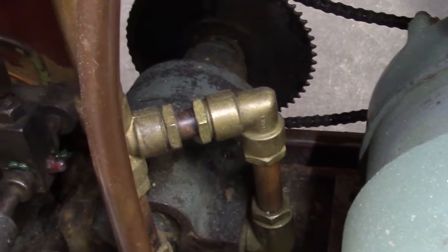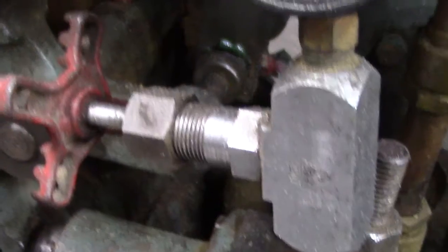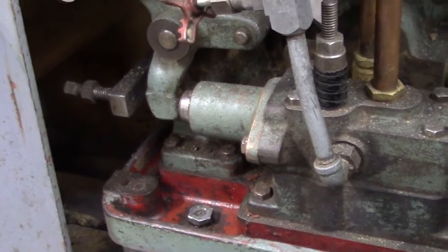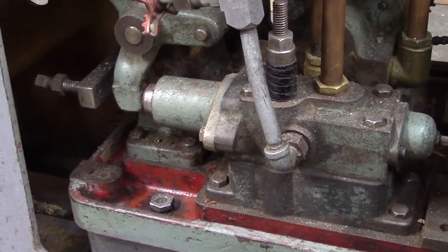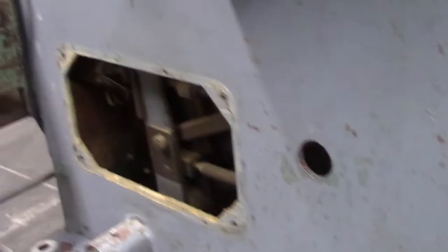This is, as I said, run all hydraulically. This is the hydraulic motor here, actually, this is the electric motor that runs the hydraulic pump right there by chain, and feeds the cylinder. So basically, when you push down on your foot pedal, this bar gets pushed back, which engages this button here that forces the head to feed forward, the saw to feed forward. So unlike a radial arm saw, this saw self-feeds. And you can set the feed rate at whatever you want to set it at, from 5 to 20 feet per minute. So it's a pretty neat little machine.